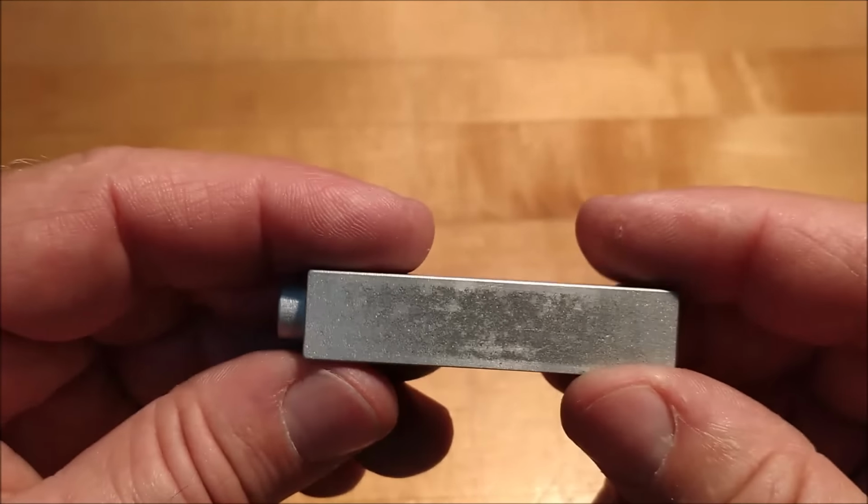And yes, I set this off camera. I didn't get that lucky on the first try. Okay, 0 for the center line, and all the moves from this point on would be symmetrical. I'm looking just to establish flat rails on what will ultimately become the bottom of the dovetail.